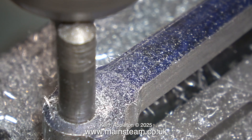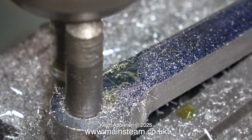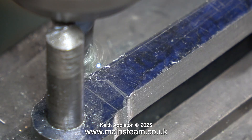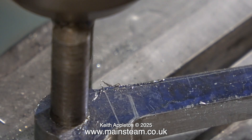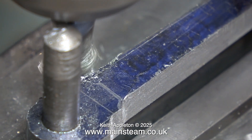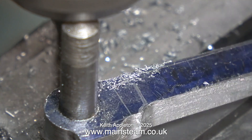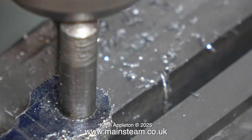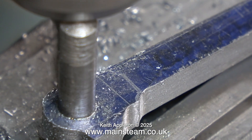I'll try it again. As the twist drill moves out of the way it disengages the contact between the connecting rod and the cutter. But using a twist drill in the end of a machine vise is not the best idea I have ever had. If I was making larger rods — like seven and a quarter inch gauge coupling rods or connecting rods — I would not use the shank of a twist drill.